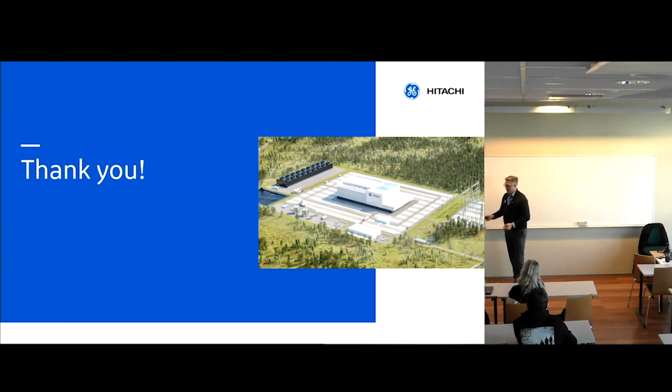And once every 10 years you have to do some key measurements on the reactor vessel for service inspection. That takes a little longer, but usually between 8 and 14 days depending on the scope. And the core is very small, so you can refuel it very quickly. The critical path is really the disassembly and the reassembly of the reactor vessels to get to the fuel. And so you take a bunch of pieces out, you get to the fuel, replace it, then you put them back together like one of those dolls, basically. No, it's basically like a stacking operation.